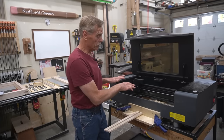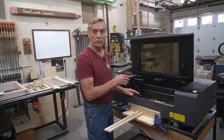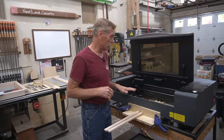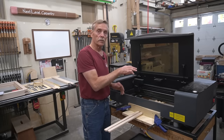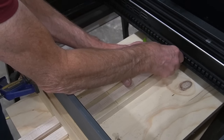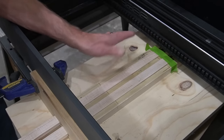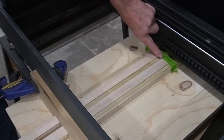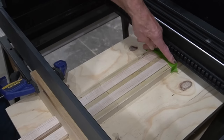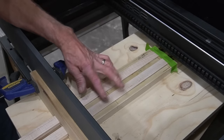The video is sped up for this part because watching a laser burn is slightly more interesting than watching paint dry, but it takes a little less than 20 seconds to burn each mortise. Because this is wood with natural inconsistencies, some cutout blanks literally fall out when the burn is complete, while others stick held by a few charred fibers. You can see the laser head at work — it looks more like a flamethrower as it burns through a full three-eighths of an inch of solid soft maple, generating a considerable cloud of smoke. Section one took five minutes and 54 seconds to burn.